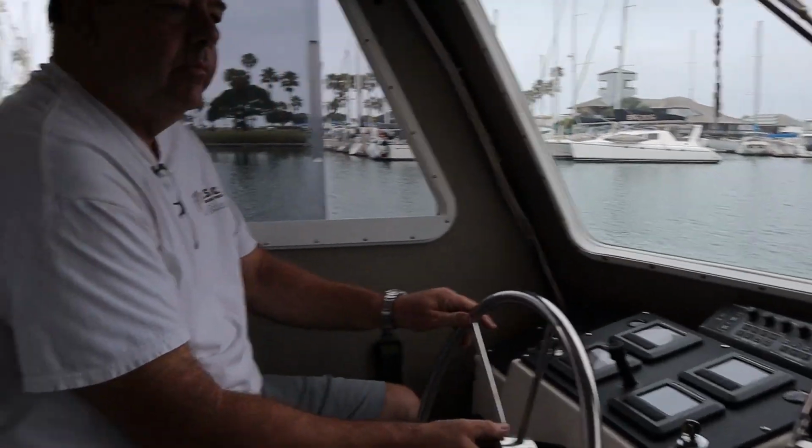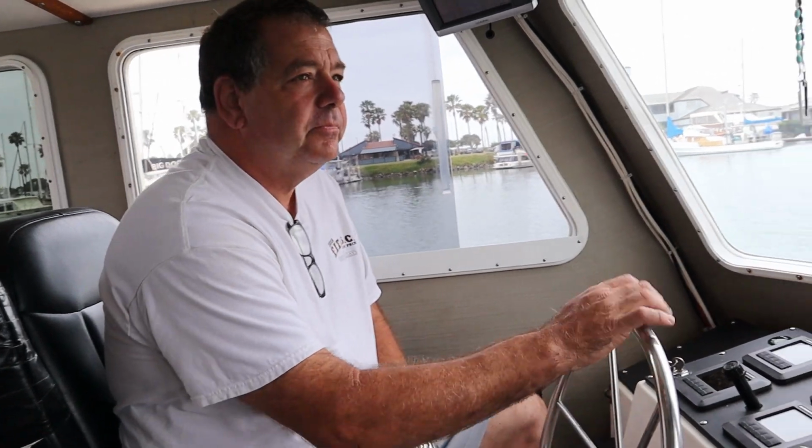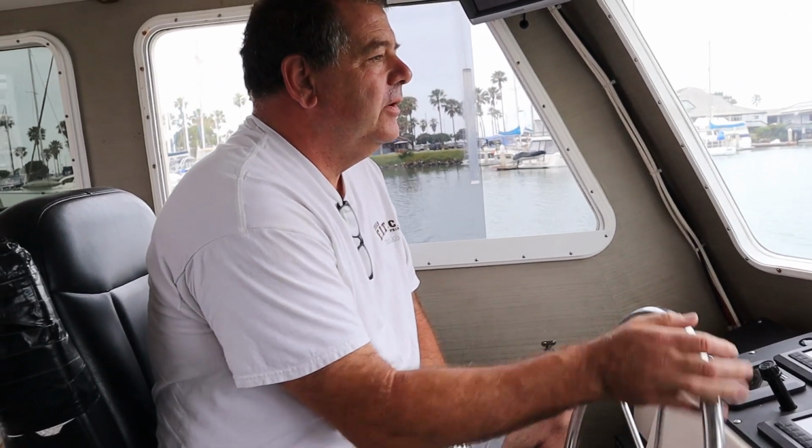Now, what was your performance with the John Deeres? John Deeres at about 1500. We used to get 12 knots. Okay, 12, and then anything over that was just a fuel consumer. To make 13 and a half, it was just chowing fuel. So it's probably going to be a similar sweet spot, right? I would think so. That's defined more by the hull than the engines. Well, it's a pretty non-displacement hull. It should get up and go.